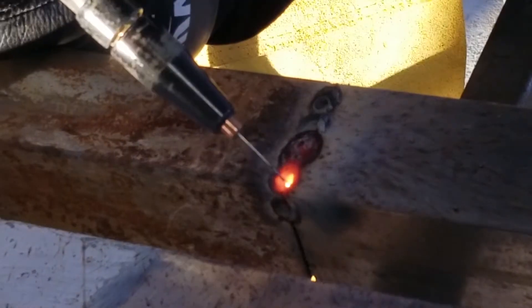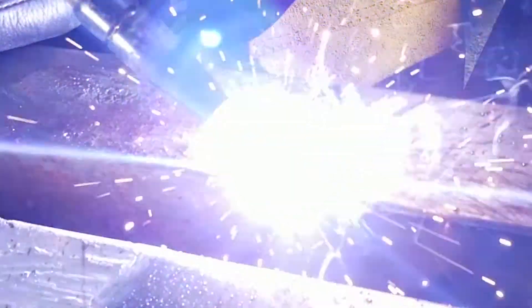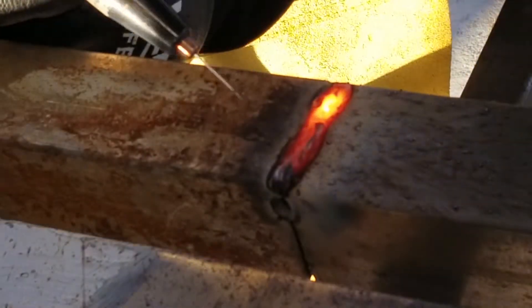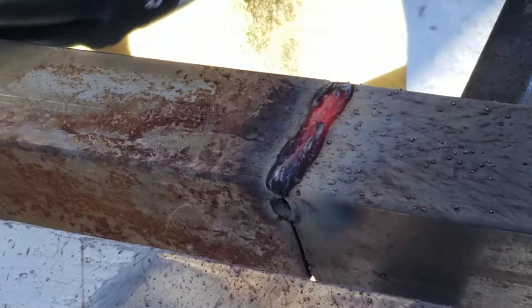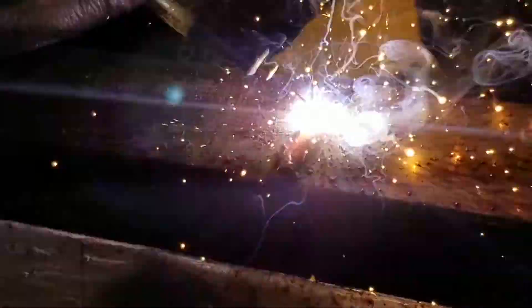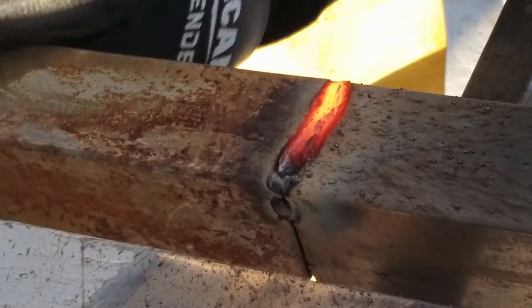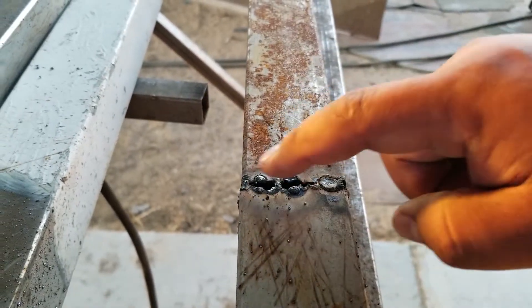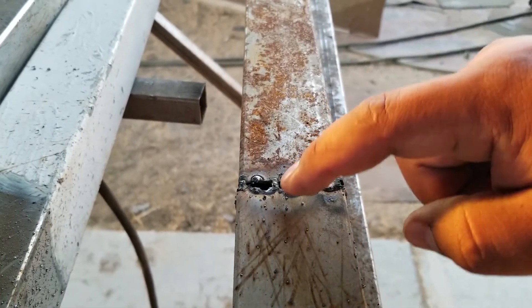Once you have everything more or less sealed up, you're going to want to go ahead and run a bead across the entire thing. That's going to heat up the entire surface where you were welding before, reshape all the welds, and any contaminants you trapped in there because of the flux core will end up floating to the surface — so you'll have less problems with contamination and porosity. Ideally you want to prevent this altogether: slow down, take it in sections, and if you haven't welded anything else on it, set up the settings before you get to the difficult part. That way when you finally get there, you know the settings are correct and the rest is just technique.